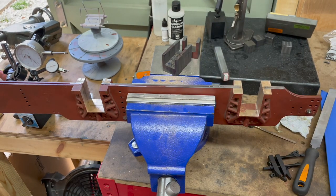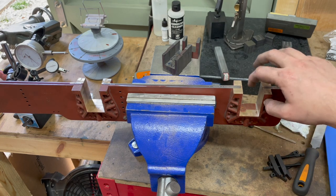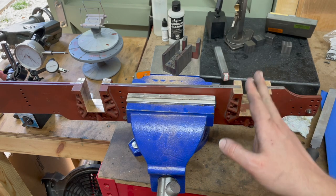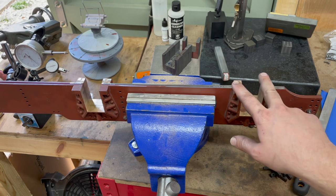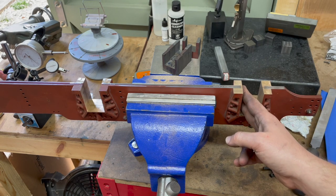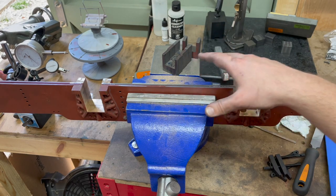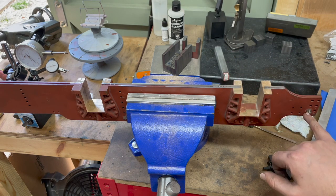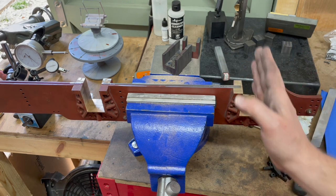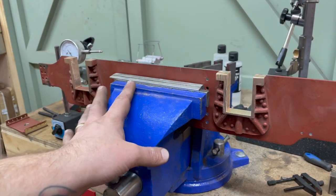We've got 1266 there, 1265 — so these holes are not only parallel from frame to frame but they are now all square and the same width: 1270, 1268, 1271, something like that. We're about 18 to 20 thou over in width, but we've now got these nice and parallel. So when we get the bolster and the frame stay back in position using the bolt holes, we can be fairly sure that the axle boxes will be aligned along the width of the locomotive.